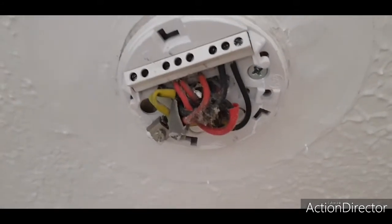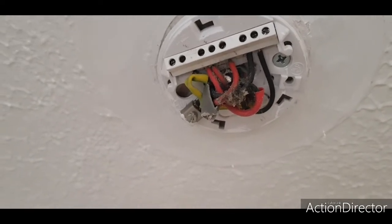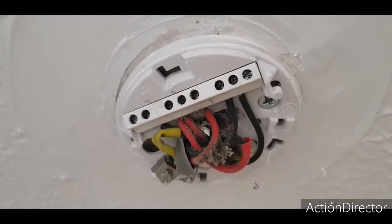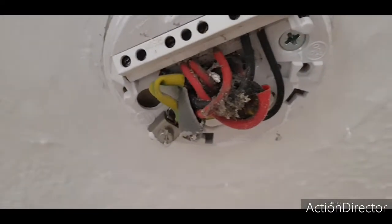There is a reason why we wire permanent mains to the switches. Not only to provide a neutral, but it just makes it easier swapping over fittings, really. Yeah, so it's not badly done, to be fair.